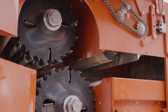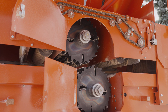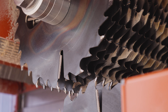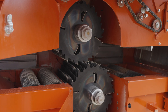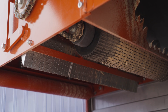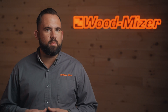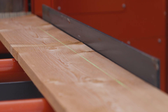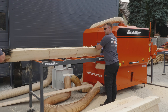This means more precision and efficiency in your cutting operations. Circular saws enhance recovery rates and contribute to cost savings with high accuracy board thickness and an excellent cutting finish. Driven press rollers positioned close to the saw blades on both the in-feed and out-feed sides allow for sawing of cants as short as 70 centimeters or 27 inches. For precision, a laser sight provides exact alignment of cants with a laser line, ensuring accuracy and reducing waste.